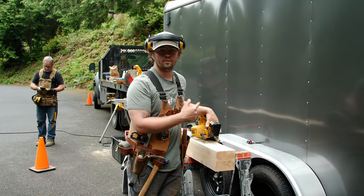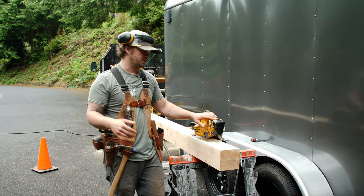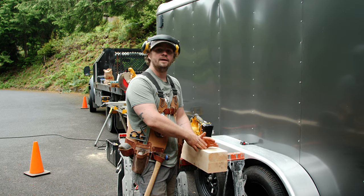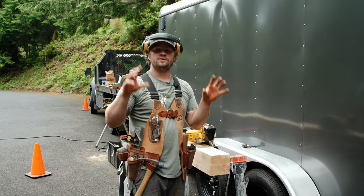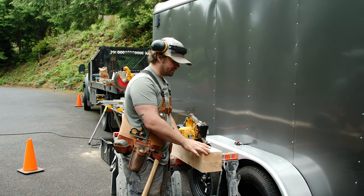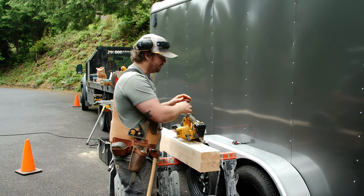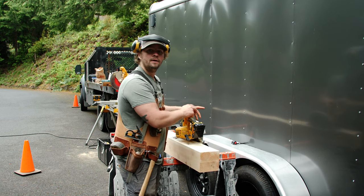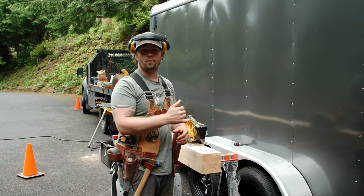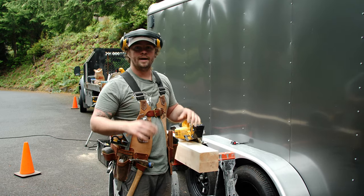In part one, if you didn't see it, go check it out — we milled all of the cedar logs to get all the material we need for this Timber Frame Pergola Project. What we're going to do is cut a tenon for a mortise and tenon joint to support the upper beam. On our beam right at the top, I have marked out five and a half inches down because that's the full dimension of the beam. I'm going to mark out what size our tenon is going to be, rough it in with the circular saw, do the rest by hand, and then cut the mortise on the ridge beam after we get both verticals leveled and anchored in.